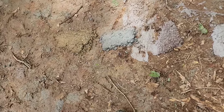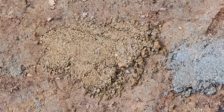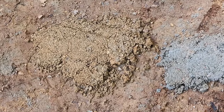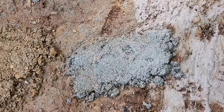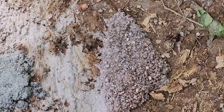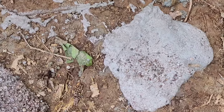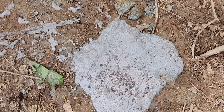I acquired these rock samples for the sake of the video. The sandy mixture was encountered anywhere from 10 to 60 feet. The next pile is your first indication of solid granite, encountered at around 65 feet and continuing all the way to about 140. At 140 feet, we ran through a 20-foot vein of red mixture rock. And then at around 235 feet, we encountered a very soft zone of this pudding-like rock mixture.